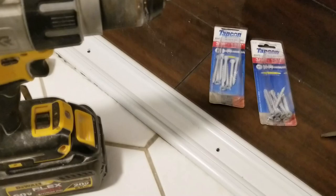So here we have to remove this old bar and here's the bottom track — we pried this up. Now we can put in this new bottom track for the mirror doors. We clean this all up, vacuum everything out, and this is going to have to straddle across the wood and the tile. That's a concrete floor there, so we're going to use tapcon screws wherever you see the screw holes, and we need to pre-drill our holes for the tapcons.